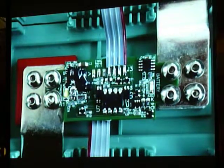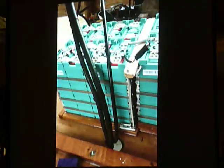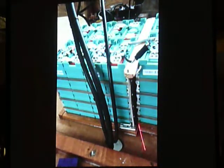So there is a close-up of the top of the cell that the BMS installed. When you install it, there's a little light that shows up telling you that you got a connection, and there's a red LED over here for healthy balancing going on. And they had to be secured to the boat somehow, so basically there's just a little tray that I epoxied on, and on the end of the battery there's a little lip, so it goes underneath the end, and then this bar in the middle keeps them from lifting in the middle, and they're completely secure. You could put the boat upside down.